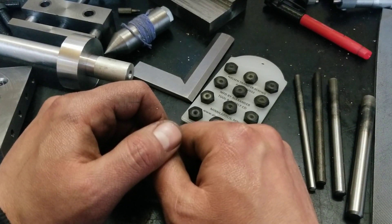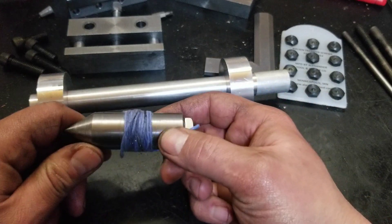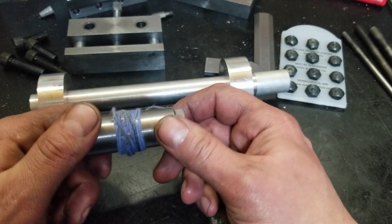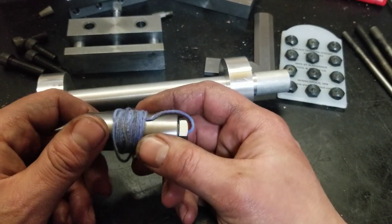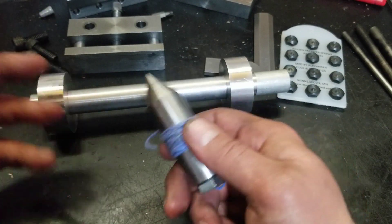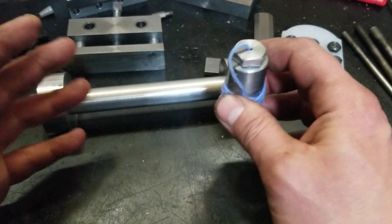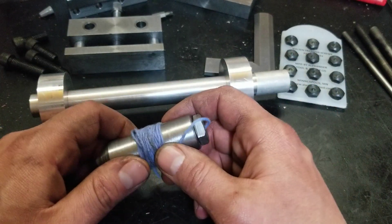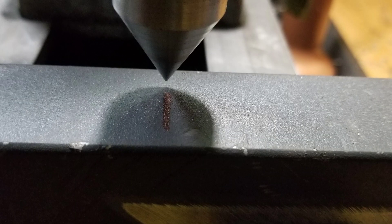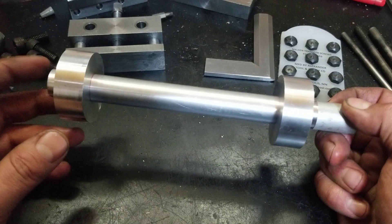The reason I was getting the cupping - I did some research and I think it was Dale's Tips and Tricks on YouTube. He had a pretty basic way to tram and level your lathe. What happened, I'm sure, is the frost thawed out and my floor, being multiple pieces of concrete flooring that have cracked over the years, caused the lathe bench to shift a little bit, twisting the ways. So I ended up having to make a gizmo with a plumb bob to level out the ways.